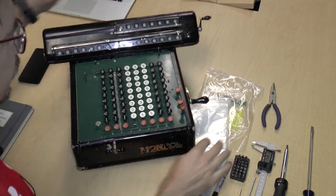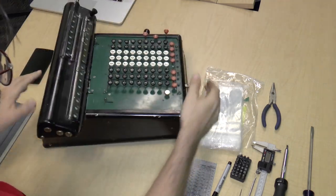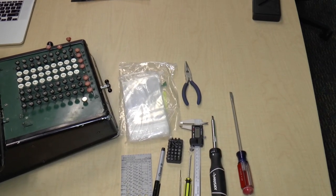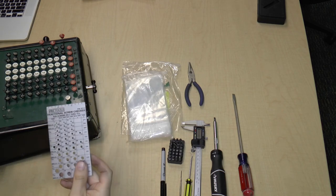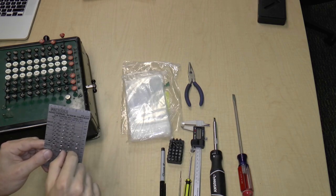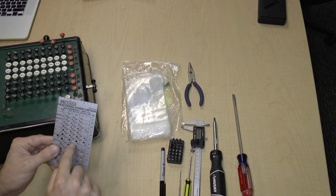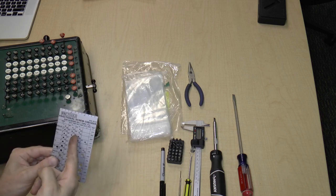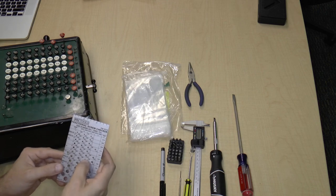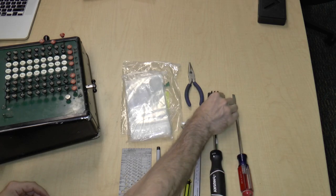In terms of orientation, this is the right side and this is the left side, with the calculator facing you. Before we actually unscrew anything, let me show you all the tools I've gathered. The first thing, and I think one of the most important, is a screw checker. What this does is you can screw a screw into these threaded holes and it will basically tell you what size screw you have. This is an imperial screw checker — because these machines were made in the United States, it only uses imperial screws, no metrics.